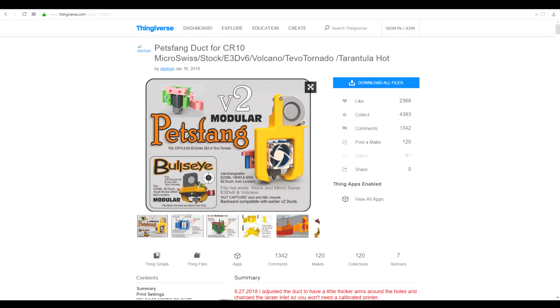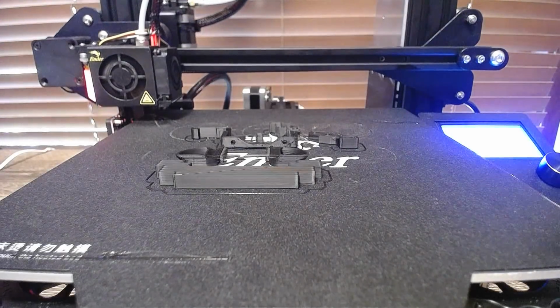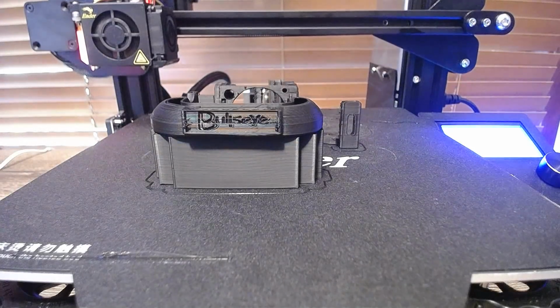Onto the main show, the testing of the Bullseye. I didn't test the Petsfang because it no longer supports the stock blower cooling fan. There are linked documents in the description which show you exactly what to print for each printer. It also tells you which way to face them and where to put support when you're preparing your model in your favorite slicing software. Installation is the same for both printers, but it's a little bit trickier than the ring vent, so let me talk you through it.